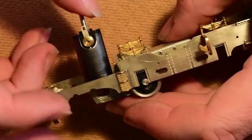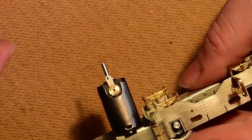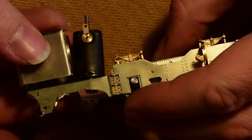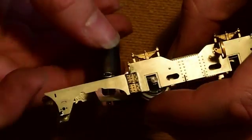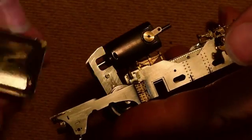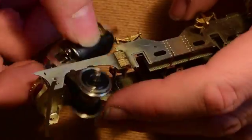The main one being that up here, the tail on the motor, I normally fit a flywheel there, and in this case I've got to cut that off in order to allow for the size of the firebox, which is only this big. That sits in there, and it can't unless I cut that off. So my general plan is to get an extended gearbox that will sit that way up. That will sit inside there, and the motor will sit inside the boiler. Exactly the same way as I normally do it.